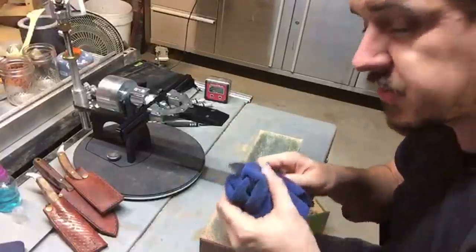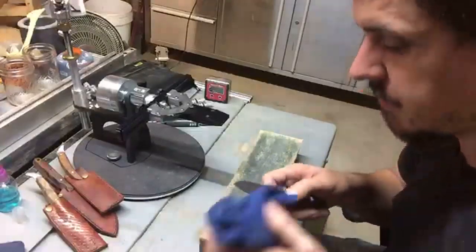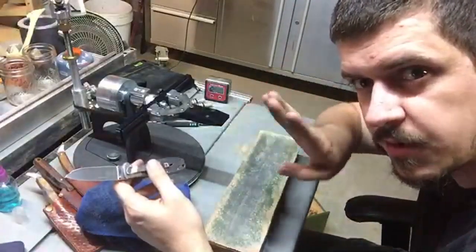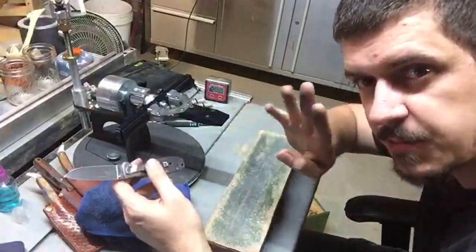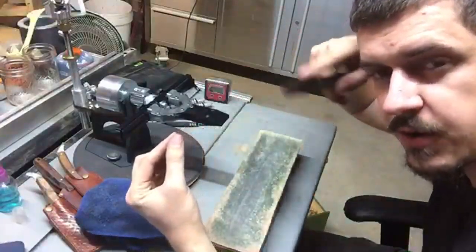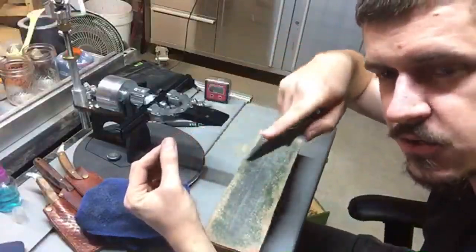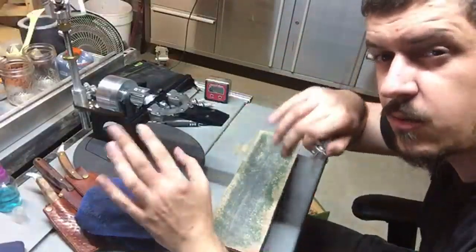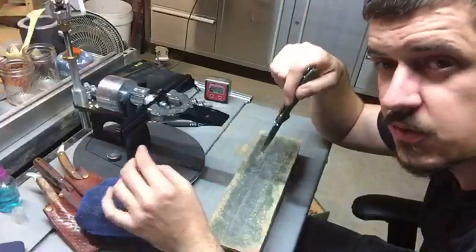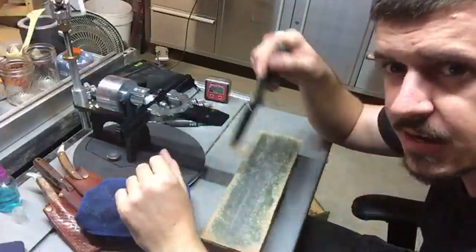That's right. Get a good bit of softwood like pine, for example, and go with the end where the grain is coming up like that, and lightly draw your blade through a couple of times. Don't really put force in there, but just make sure the entire edge goes down there. It really knocks off burrs, and then a good stropping brings it to just an amazing edge.